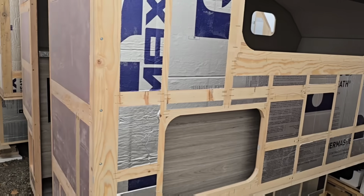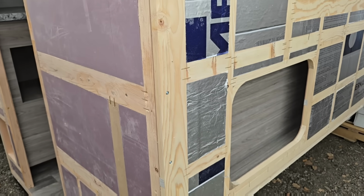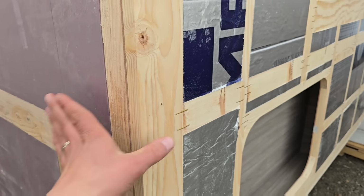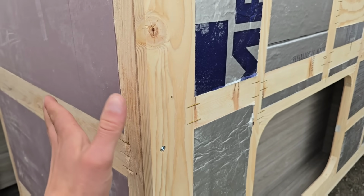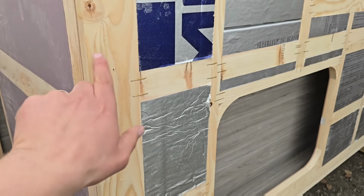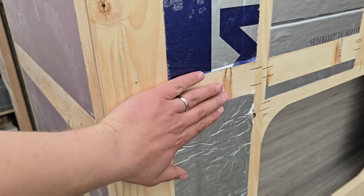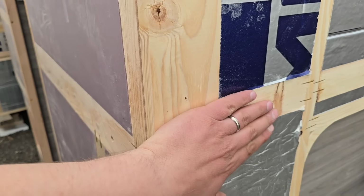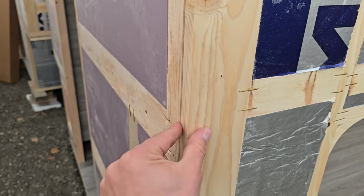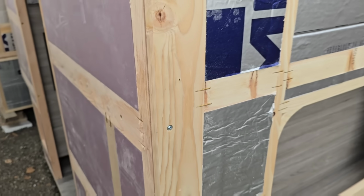But over here, and I have videos on this, guys, you can go and look at the skinning process over on the channel. This right here is a bent piece in the brake, and just where my thumb is, and then my hand, this piece goes on like that, right? And then it gets a layer of sealant, and then the side sheet comes over top of that, so it's now a lapped corner. And then on top of that, you put your Mobilastic rubber around the corner, and then you put your rail on that. So it looks like this.